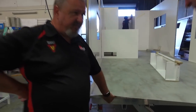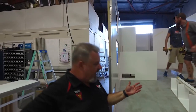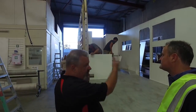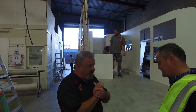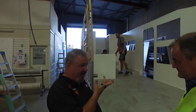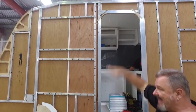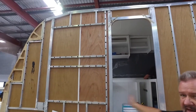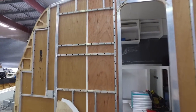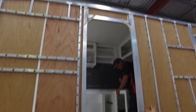The advantage of this floor is in its insulation value. Heat rises and goes up, so by having an insulated floor, we've made the rest of the insulation effective. If the floor isn't insulated, then the rest of the caravan is all it's going to do is create a heat trap. We also insulate our windows by having double glazed windows as well. Double glazed windows, insulated floor, insulated walls, insulated ceilings — it's a fully insulated van. You'll notice also that our wiring is actually in the roof and cascades down the van, so the wiring doesn't run across to cut the living daylights out of all the framing. By cascading it from the top, it also gives us the ability to capture the maximum amount of area that we can insulate.